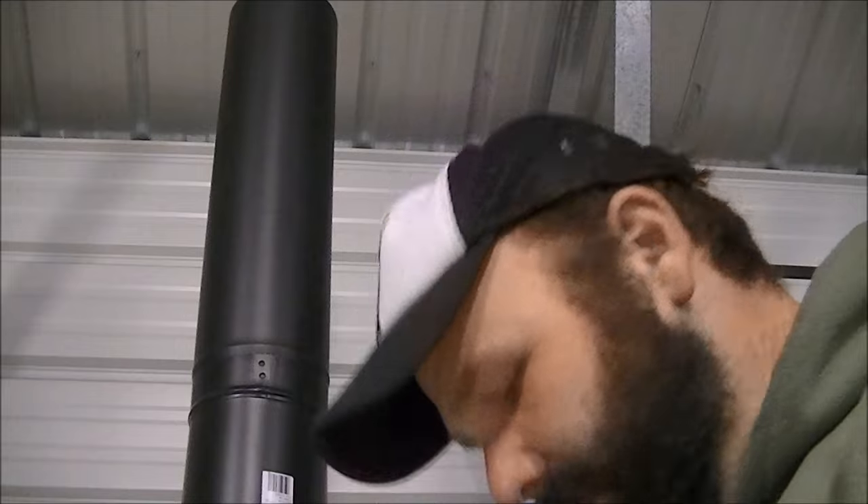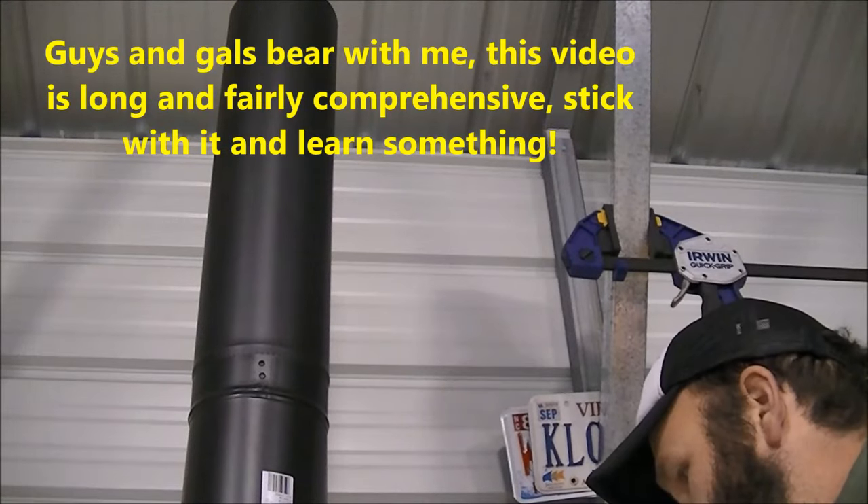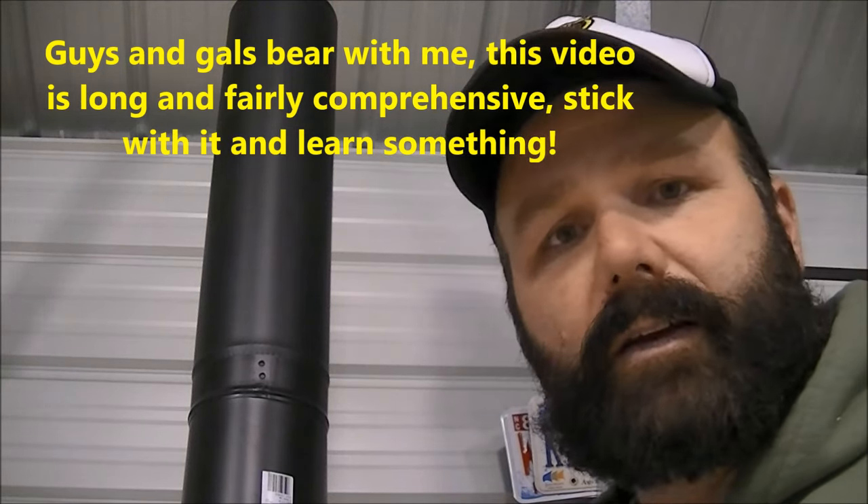Let me tell you about my clearances from the wall. The stove itself is 17 inches from the wall, which brings the stove pipe out to about 18 inches from the wall. This is a non-flammable surface, so it should be good to go. I don't want to get the tin really hot on the other side and discolor it — I want things to stay pretty. I want to do my best, so this is my best.